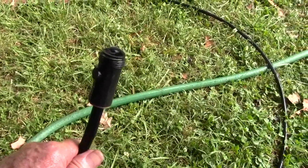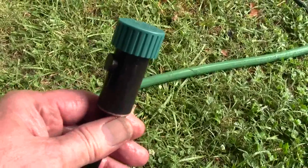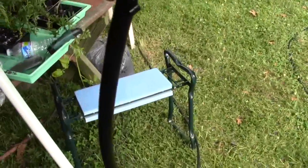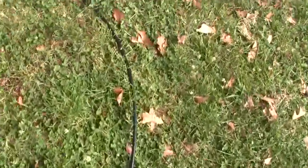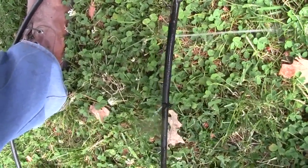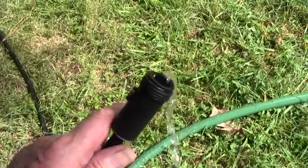Now I'm going to put a cap back on this and turn it back on. But that's not a lot of water pressure. Now I have put a cap on this line, and that water's coming out a little bit stronger than it was. And these are the drippers at 100 feet and there's nothing coming out of them. You can see it dripping — see it spraying? You can hear it. That might be part of my problem — one of the emitters has come out. Let me pop one in there; I'm losing a lot of pressure there. I put the emitter back in the hole where it came out of — there's a little more water pressure.